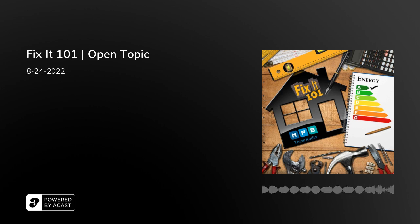Number one, take all the siding off and go back with your concrete board. Number two, if it's not in the budget, cut up a foot or so, and you could do some Z-flashing, and then put your lap siding under that piece of T111. I don't like that look. I'm going back to option one. I'm taking the siding off.